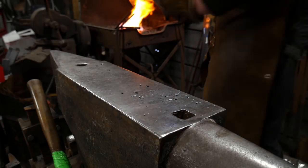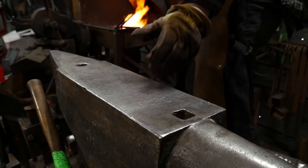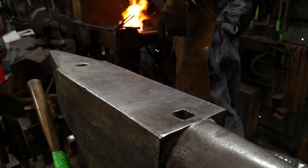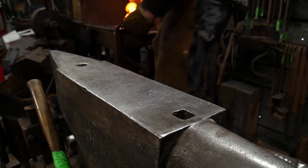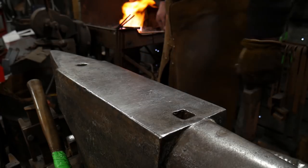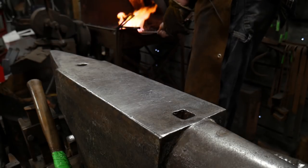We're wanting that to look just like that. Now how do we turn this into a scroll? You might think we'll continue going in the direction that the bean pods are already curving — but that is the magic of doing this bean pod end for the scroll. You actually want to go opposite of that, to make it look like that bean pod is just dangling there off the end of a vine. If you need examples, search Google Images for bean plants — that's the easiest way to educate yourself on what a bean pod looks like hanging from the vine.